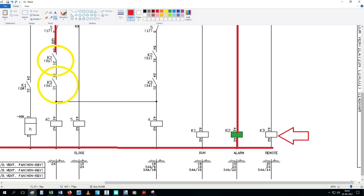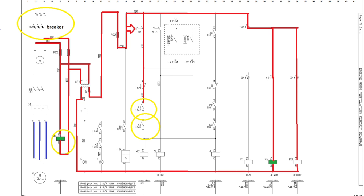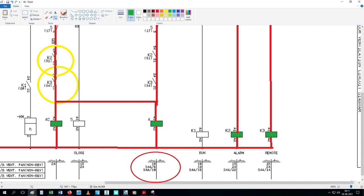Another relay affected by removing the VFD connections is the K3 relay. Its main function is to provide controlling contacts for 4C and 4, and for remote operation. I decided to tap it directly to terminal X11. Once K3 is activated, we will have a closed circuit for 4C, which will also activate the 4C contactor.